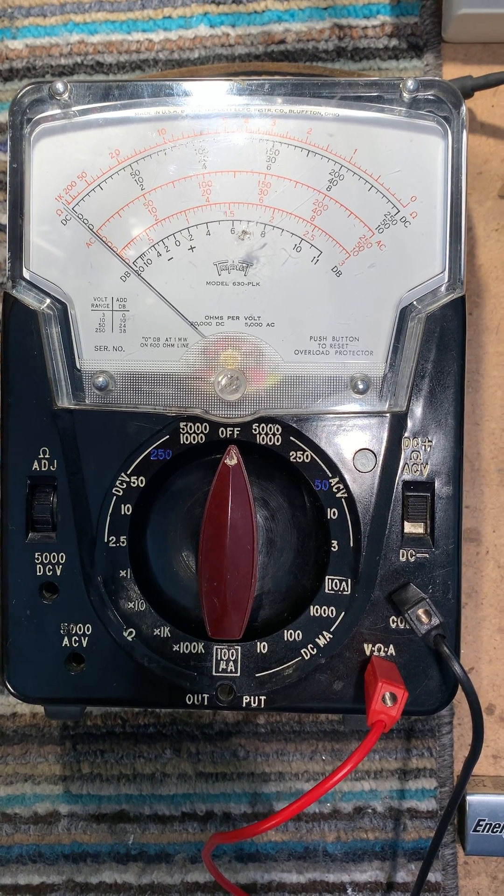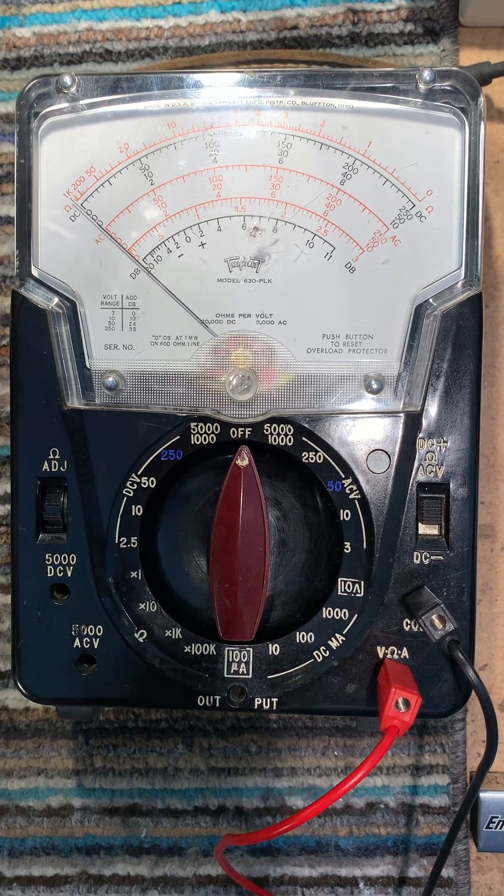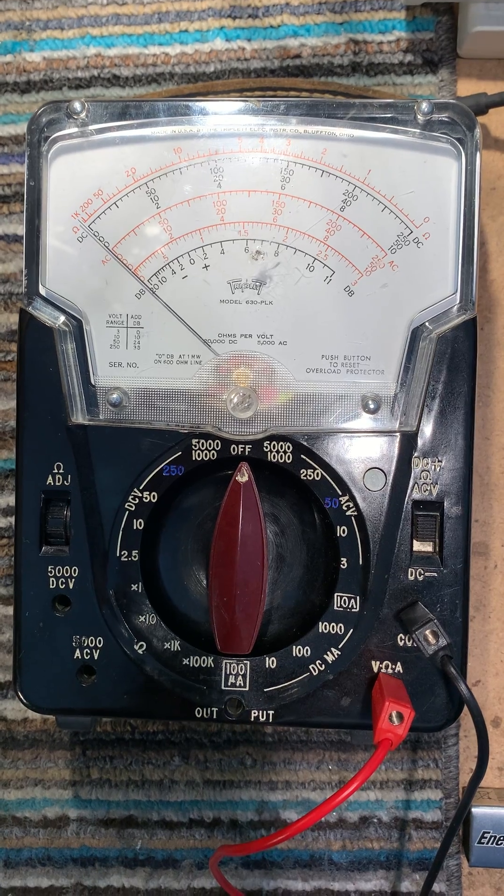With the new device fitted it uses less than 0.2 microamps, so hardly any draw. And if it's in the off position like it is now, it doesn't draw any current at all.